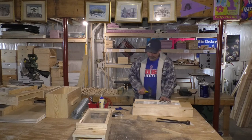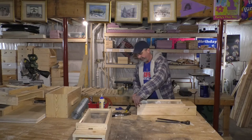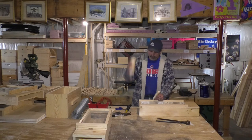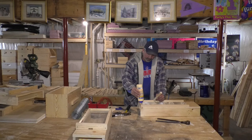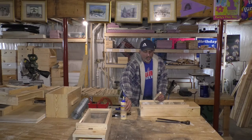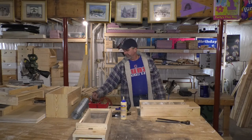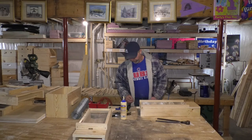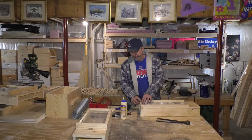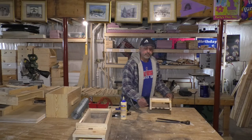So that's there. One more piece on the back, which is gonna go right there. I've already had it pre-cut. That's gonna sit there. Here again, get the glue out. Now on this piece, I am going to use the smaller nail. Can you figure out why? I've learned the hard way, this longer nail, when you go to hammer this through, that nail's gonna pop out in here.